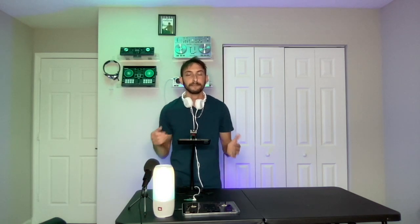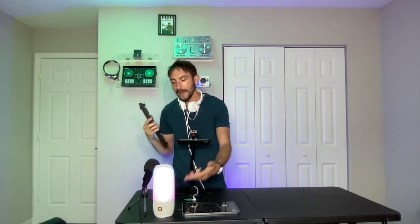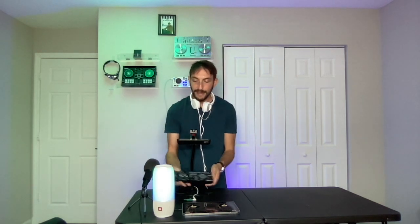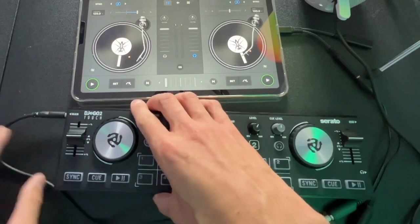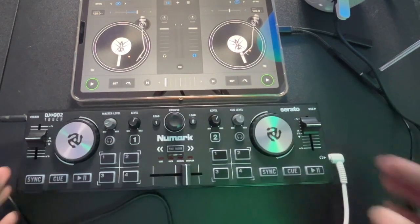All you need is those two adapters — it's really easy to do. Do I recommend doing this for professional gigs like a wedding, a bar mitzvah, or a big high-paid gig? No, I don't. The more adapters you plug into your iPad, the less your reliability. So if you plan on doing this professionally and you don't want to spend a lot of money, I would highly recommend getting the Numark DJ2Go Touch, because by the time you buy the adapter for the iPad and this splitter cable it's going to be around $30-$40, so you could just spend around $89 and have this controller with a built-in sound card. Then you plug in your audio cable to your main output and simply plug in your headphones with no adapters — you have the same result.